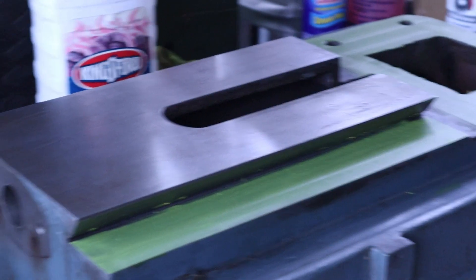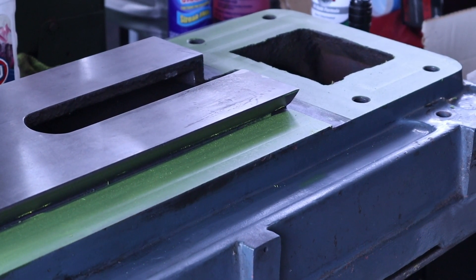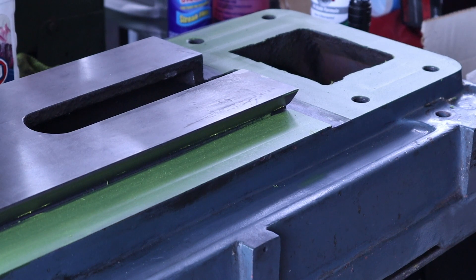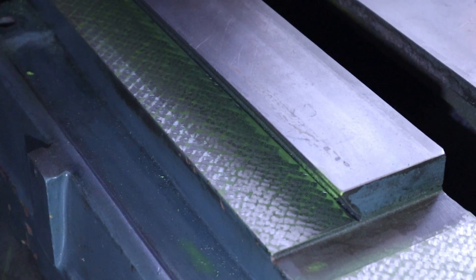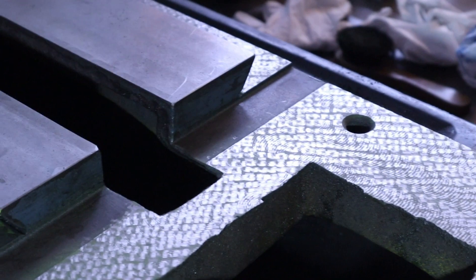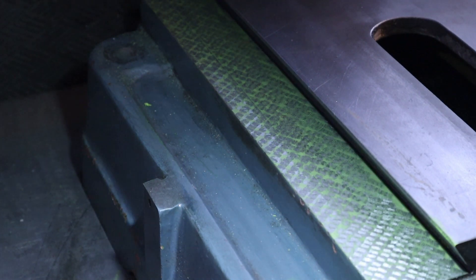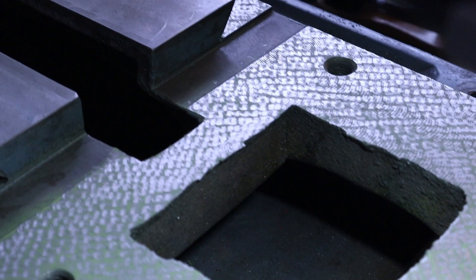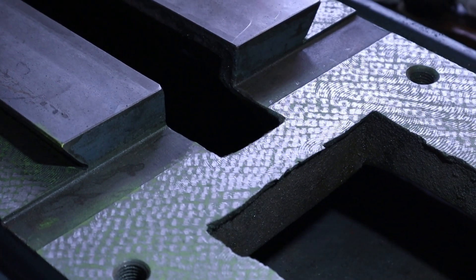It's blued up — I use yellow but we've got a little bit of yellow covering all the surfaces. I'll make a nice roughing pass with a scraper, then we'll stone it and start seeing where our position relatively is in relationship to the three surfaces we're looking at. This is after the first scrape — I haven't stoned this down yet. We just covered the whole surface with a nice crisscross, and that'll allow the surface to be relatively smoother. I'll stone this, measure it, and continue to scrape.